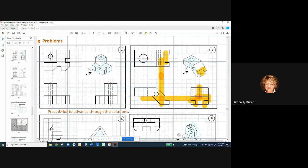How many views and which views? We have to have this top view because of the hole — it also locates these and shows me how big they are. This view shows me how tall they are. We have to have this view for the profile and the hole. So maybe we could get away with two views and not have the right side view. How do we know the hole is not a through hole? The hole is a through hole, but this hole only goes two units deep. The side view shows it only. The center line shows how deep the hole goes — the center line stops right there, showing that that hole stops right there too.